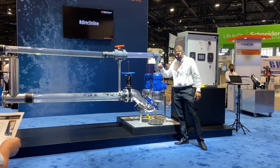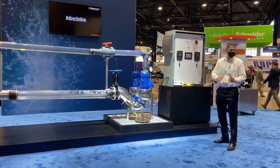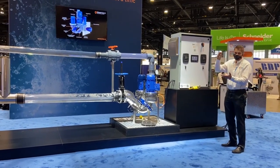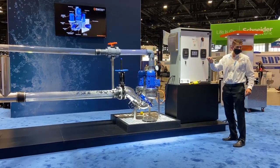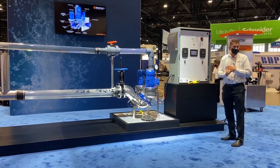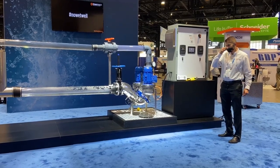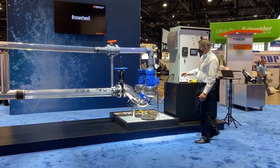So because we've got rid of the wet well — this is now a dry, odorless pit — we don't have to worry about wet well maintenance anymore. We already talked about the separation or solidification layer, all the grease that accumulates on the wet well walls — no longer there. Never have to worry about vac trucks coming in every few months to suck out wipes, because we're constantly injecting them through the system.